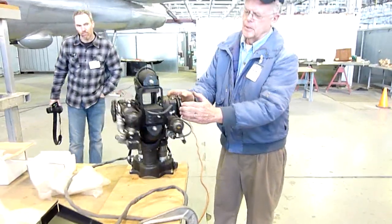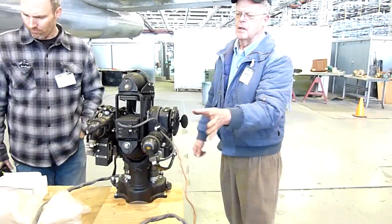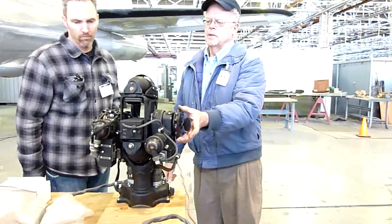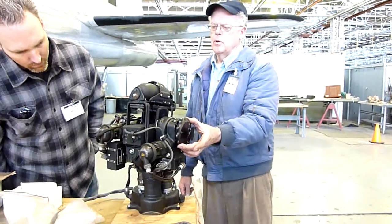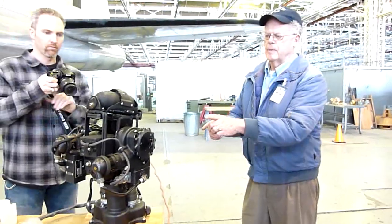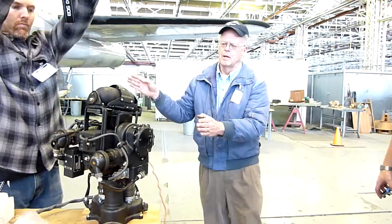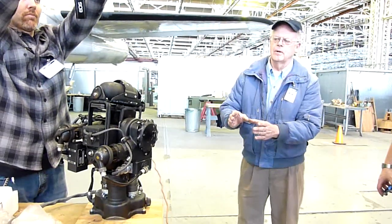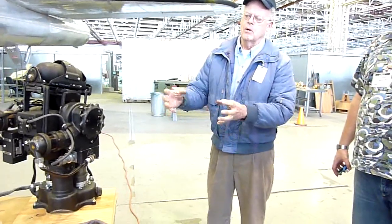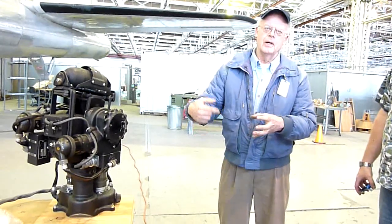You have a Selsyn for azimuth, and you find a Selsyn for elevation. You have similar devices on the mount themselves. So when the system's working, as soon as you move, you create what's called an error voltage because you're not sighting exactly the same direction as the mount. It takes this error voltage, amplifies it first through vacuum tubes, then it goes to what's called an Amplidyne,